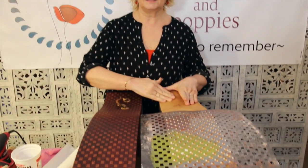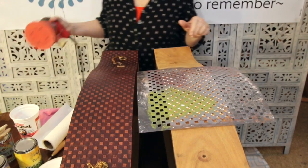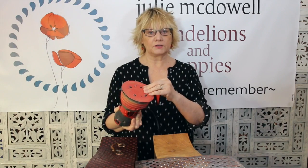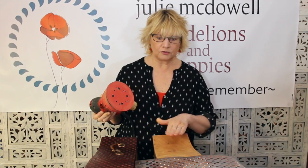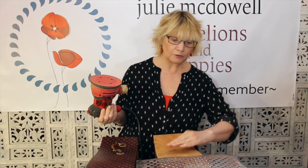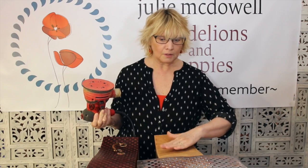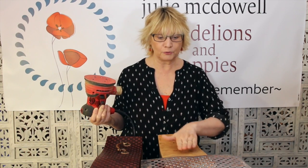It had layers and layers of varnish and polish and dirt. So to prepare it, I used this rotary sander with an 80 grit disc on it and very, very carefully sanded. Now you have to be careful when you're doing pieces of furniture like this because they're not solid wood. It's plywood with a very thin veneer of wood on the top, and it really is thin. And if you go hell for leather, it will just go right through it.